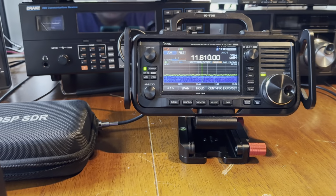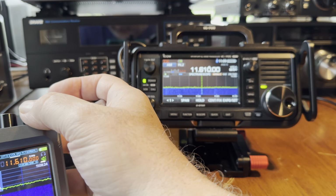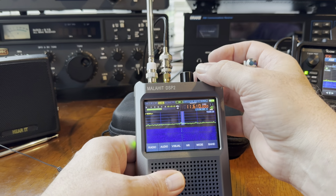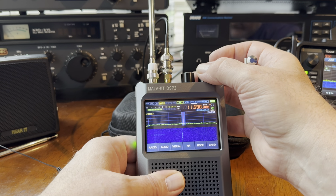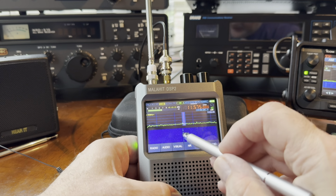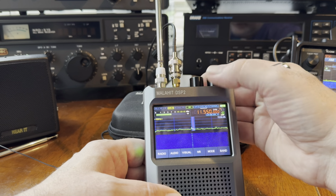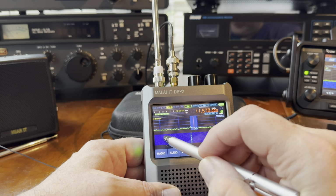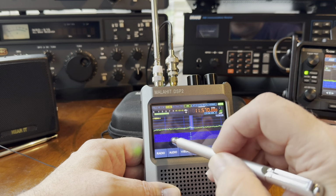well, maybe they're in different ranges. Hold on, let me check that out. Well, let's tune this and see what happens. Maybe I was wrong. No, so we keep tuning down, see? And we're not getting any closer to that other signal. So that's like in some erroneous thing. See that? It stays there, but we can never get to it. Oh, and by touching this, I changed the width. You touch, see that? 50 hertz, 200 hertz, 192 technically.